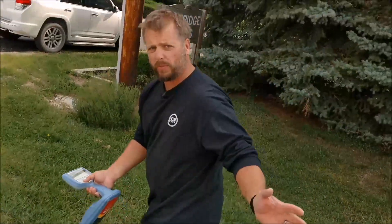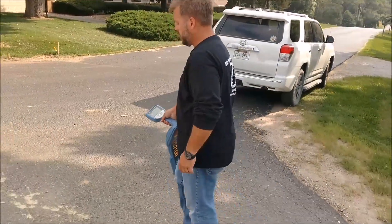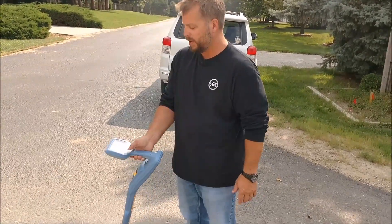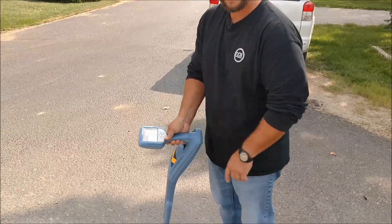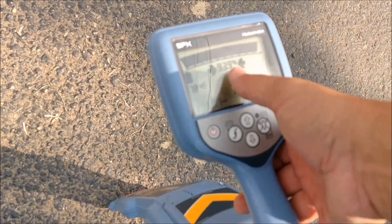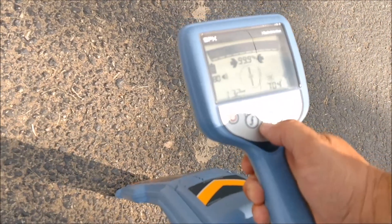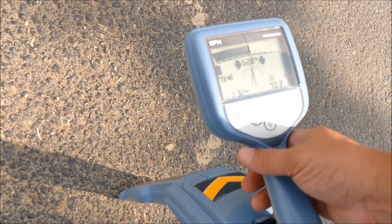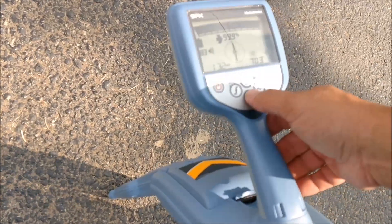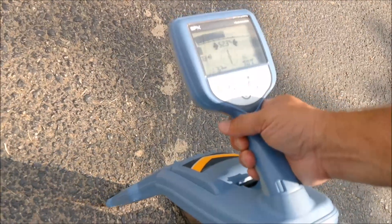As I continue my locate and get further away from the transmitter, I'm going to lose current on my screen — my signal is going to get weaker. When my signal gets weaker, my numbers aren't going to go as high, so when you need to increase the sensitivity of the antennas, just hit the up arrow and increase it. Now I'm at about 75 instead of 70, and you can see as I increase it, my numbers will go higher on center of the screen. You can run it as high as you want, just as long as you don't hit 99.9 — once you hit 99.9 your scale doesn't go any higher and it's hard to see where it's exactly peaking. Leave it below 99.9, usually around the 50 percentile range. All I did was hit the down arrow once and it automatically adjusts to the 50 percentile range, so I can see exactly where the peak and null response is.